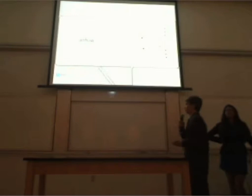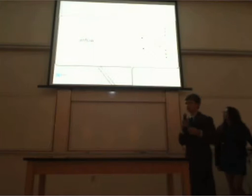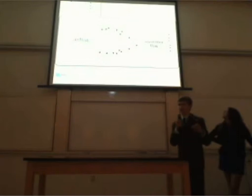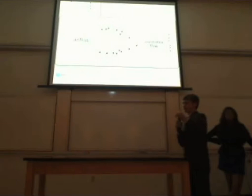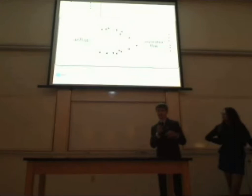The style that we were actually testing was the turbulent boundary layer theory. When a smooth ball moves through the air, it has separated flow behind it, and there's not very much turbulent air, so it causes a lot of drag — almost like a low pressure vacuum sucking the ball back. With a golf ball, the tiny pockets cause the air to become turbulent, and that turbulent air filters back into that space and makes it smaller, decreasing the overall drag, although it does increase drag on the surface of the ball.